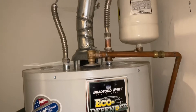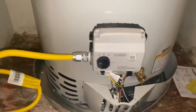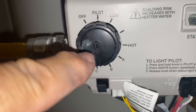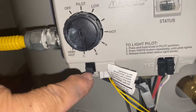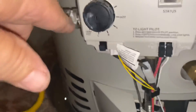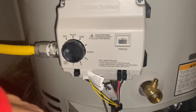It's hooked up correctly on the vent lines. I just got to put in the straps. Here's how you turn on the water heater — basically it's on now. You go in here, put it on pilot, and this black button you push in and hold for a little while until gas starts coming through the valve when you first light it. This right here is a striker — basically like a flint, like a spark. Push it in a few times until you see, in that little window there, a little flame — you'll see the pilot light. You have to hold the button in until the pilot light stays on. The thermocouple, which is this line here, holds the heat and tells the brain what to do. It goes all the way down, heats up, and communicates back to the brain. That's how it works. We've got a pan on too.